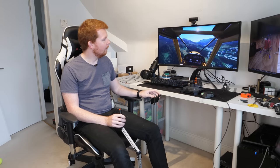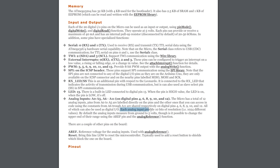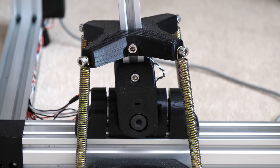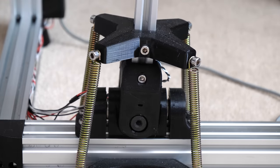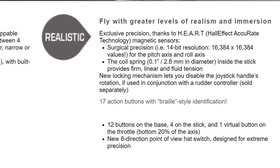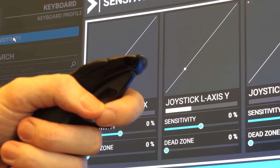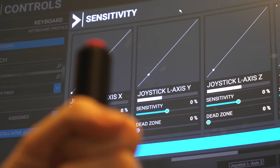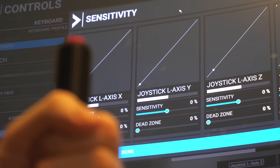Because I'm using an Arduino micro to read the analog signals from the sensors, the precision is ultimately limited by its input resolution, which is 1024 different values. This may seem like a high resolution for a 12 degree pivot, but some of the expensive joysticks boast resolutions over 16,000. When comparing it to my old joystick, which apparently has a resolution of 256 different values, it's quite a bit more smooth. And because the magnetic field is linear throughout the joystick rotation, it essentially has zero dead band in the center, which I can't say the same for my old joystick.